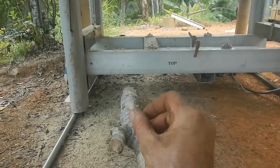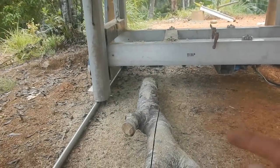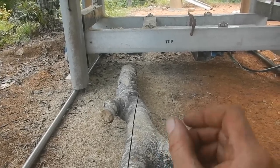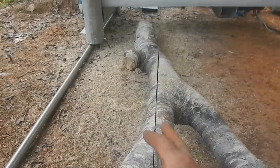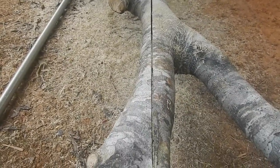Well, before I do that though, I just have to admire the blade, not the blade thickness, the cutting thickness is really good. So my blade has a tiny bit of a wobble when I mounted it on there and turned it all the way around. It wobbled like, I don't know, less than a millimeter back and forth as it went around, and I figured that was acceptable. It would cut a slightly fatter line. Oh yeah, that's really barely connected.